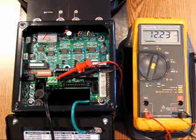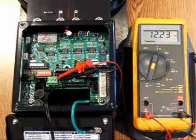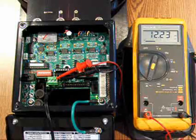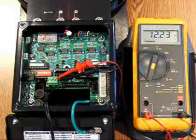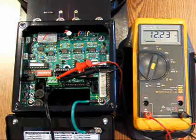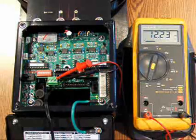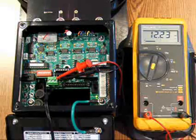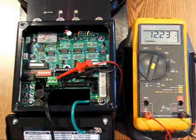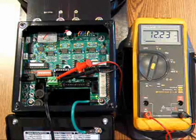I've soldered the lead wires to the strain gauge and powered the system back up. I've also connected a meter to the torque output terminals 1 and 2 on the black output connector. With no load on the shaft and the measurement of torque in either direction of shaft rotation, you'll want to set the torque output such that 12.00 milliamps corresponds to zero torque load on the shaft, with 4 milliamps indicating full-scale torque in the negative direction, and 20 milliamps indicating full-scale torque in the positive direction. As you can see, there's an initial offset of 0.23 milliamps present in the strain gauge.